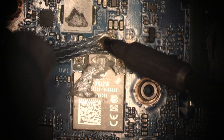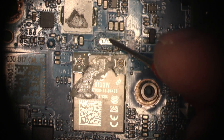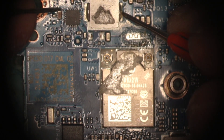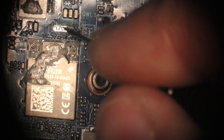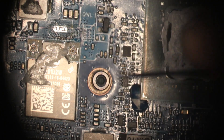Let's look at this one first. I'm going to separate that solder junction. That will disconnect the regulator's output from the rest of the system, and then we can recheck the resistances to see if the short is on the regulator side or the system side. With that bridge removed, the coil is no longer short to ground, and it's also not shorted to its input voltage, so the regulator seems okay. We get five volts, so I guess that's the five volt rail. The coil close to the GPU is GPU core voltage — low resistance on a GPU core is normal, so I'm not worried about that.